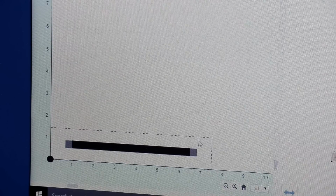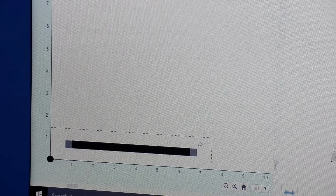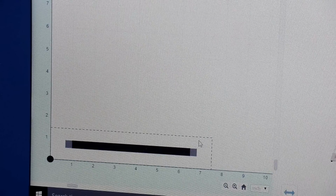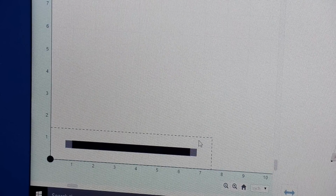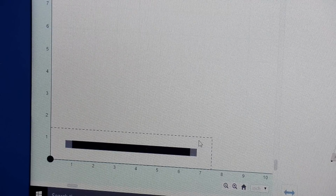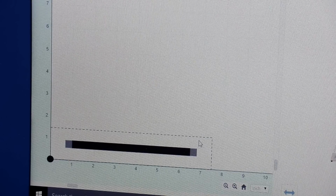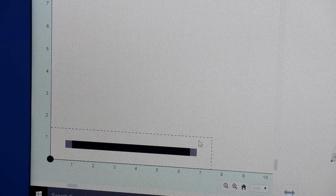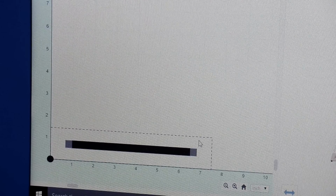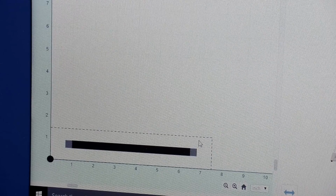We're going to carve this out now, but for when you do this, my cut files are going to be available in Easel. You can use my design, but you're going to want to adjust it a little bit for exactly the thickness of your material and exactly the thickness of the acrylic that you decide to use. We use 3/8 inch acrylic, but that's nominal, so you've got to measure it, get it exactly the right thickness, give it just a little bit of extra space for the acrylic so it can slide in there nicely. So you're going to have to make some adjustments when you make an edge-lit LED sign for yourself.